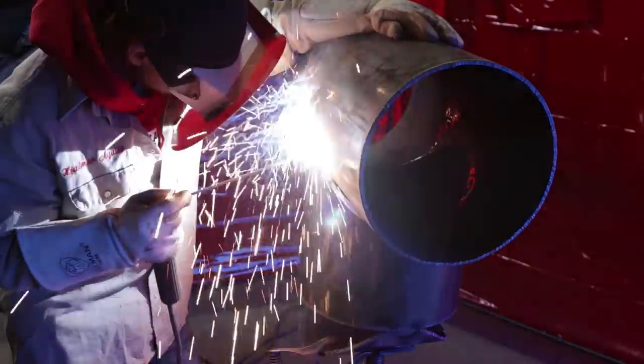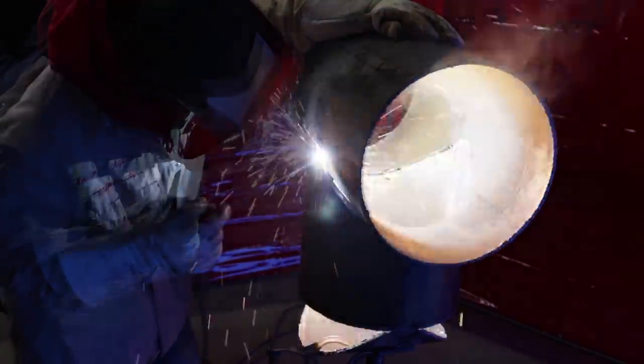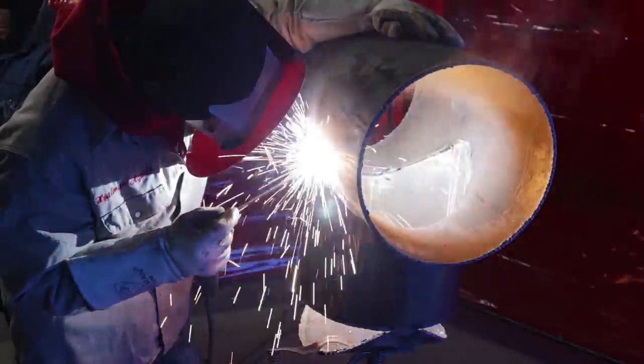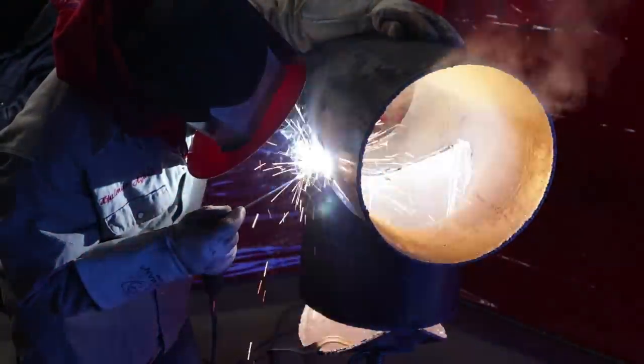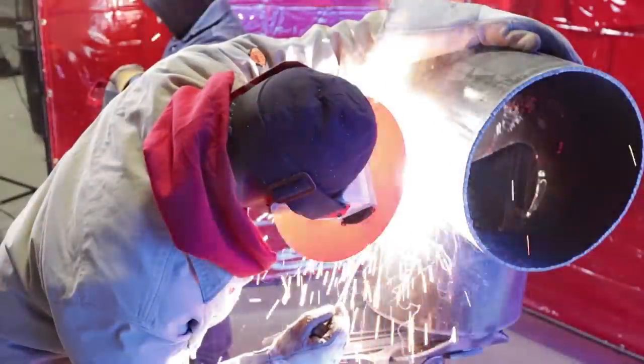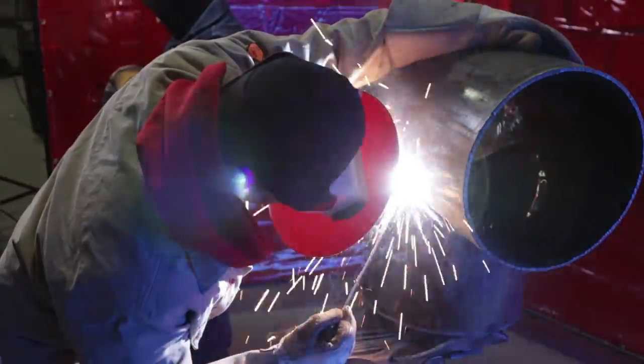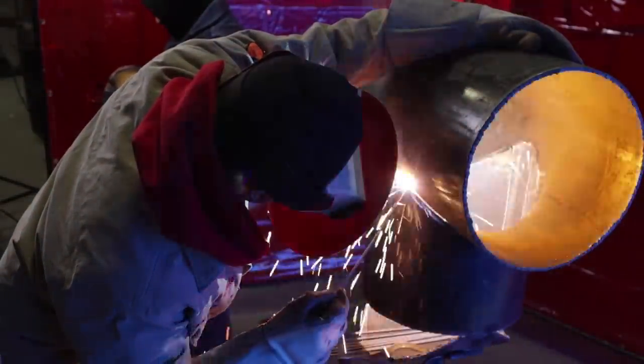It just depends on your fit, guys. Make sure your fit is good. Now, a big gap like that, I go third gear and 25. Just make sure it's hitting both walls. That's all that matters. If it's hitting both walls, you're fine. Make sure you feather your tacks real good if you want good tie-ins, okay? All right, right here, starting to come downhill on the ears to the throat.